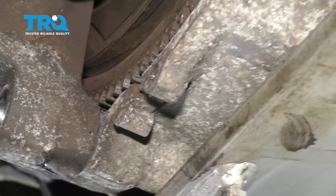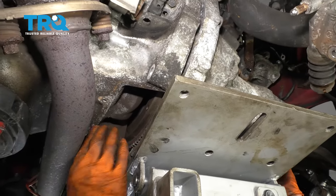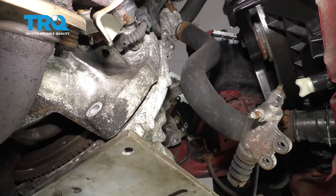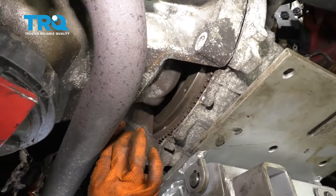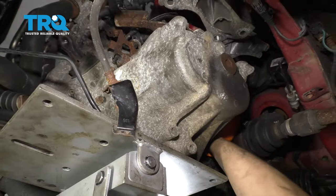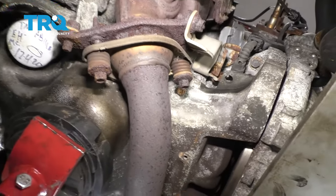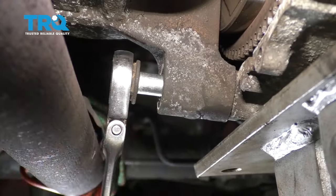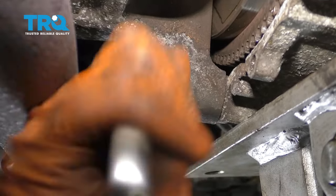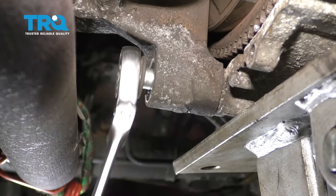I see this one wants to start — it's somewhat lined up. Did that just do it? Yes. Now you can line up the bolts. That's exactly what you're looking for — you want it to fall in by itself. Like I said, you don't want to use the bolts to pull it in. I have both of my dowel pins lined up — when it fell into place only one lined up, so I had to just move it around a little and jiggle it into place. Now I'm starting on my bolts. I'm not going to go all the way, but I want to get it close and then I'll put in the other ones because it's not 100% set in until they all get tightened.